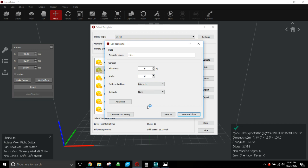A couple of the tabs we'll just ignore. Even if there's stuff in them, it doesn't matter — if you don't choose supports in IdeaMaker, it won't load those support variables into your G-code. I do use a brim. For shells, zero infill and a whole bunch of shells — you can set six, eight, or even a hundred, it's only going to use what it needs, typically around four, since the lithophane isn't very thick.